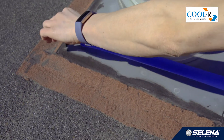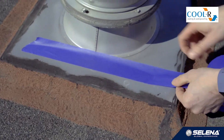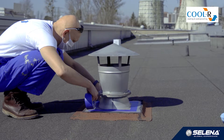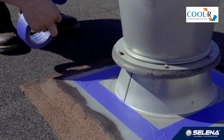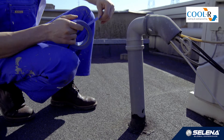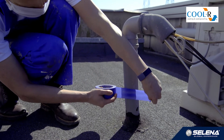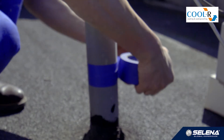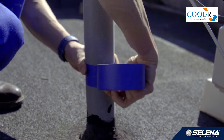There are two options available. Option 1: we apply tape and prime the entire area of the roof where the resin will be applied. This works best when it is certain that the work will be conducted day after day. Option 2: should there be a longer break between gluing the fabric to reinforce the flashings and placing the first hydro insulation layer, we recommend to only prime areas of flashings and only prime the rest of the area a day before the first layer is applied.